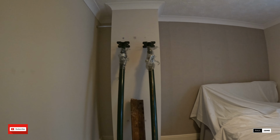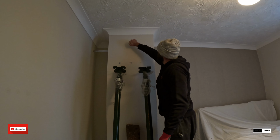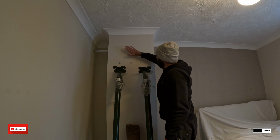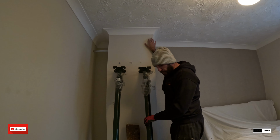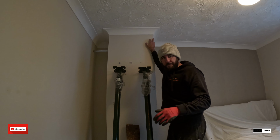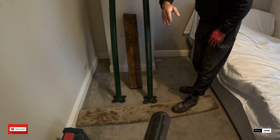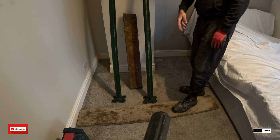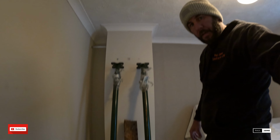And this is it. Because we haven't got access to get to that top level, all we're gonna do, again, it's quite hollow here as well, is punch a couple of holes in it, and then we've got two Acros, two strong boys. We have got a needle as well, but because of the way the joists run into it, we're gonna put a ball down, and then we'll prop off of that.